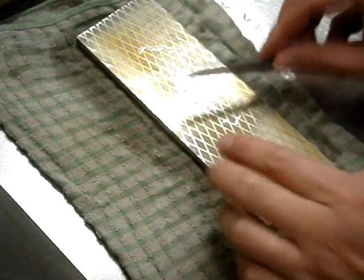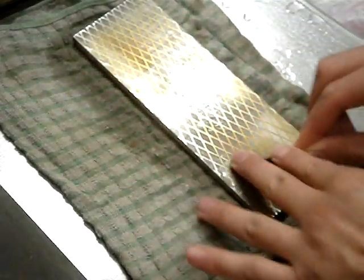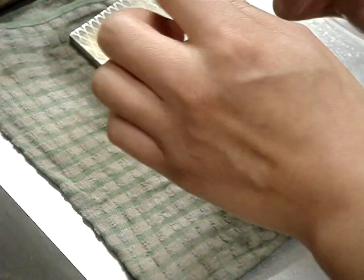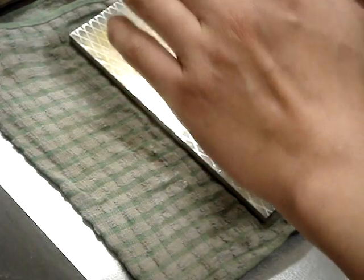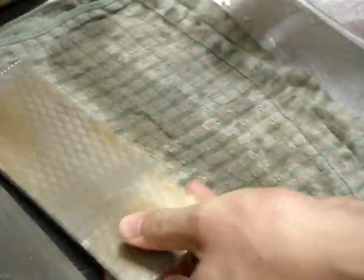And if you have a cheaper chisel, and you have to do a lot of this back lapping, what will happen is you will basically wear out those side pieces here, and you will get what's known as a flat back, which is, the chisel still works, but it's kind of taboo in the traditional Japanese tool world, so don't do that. This is already there now. I've got a nice even scratch pattern all the way down, and I've got two nice flat areas on either side.